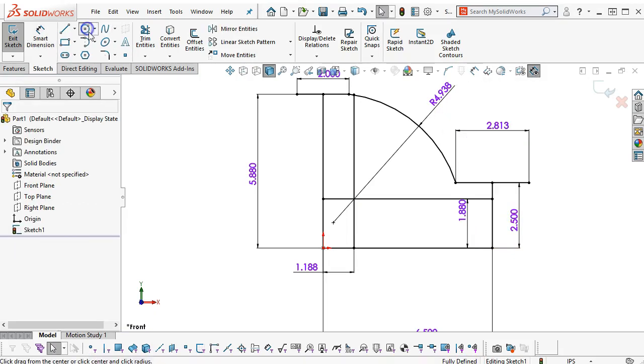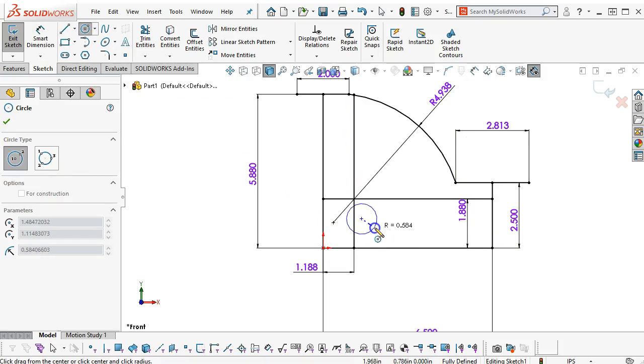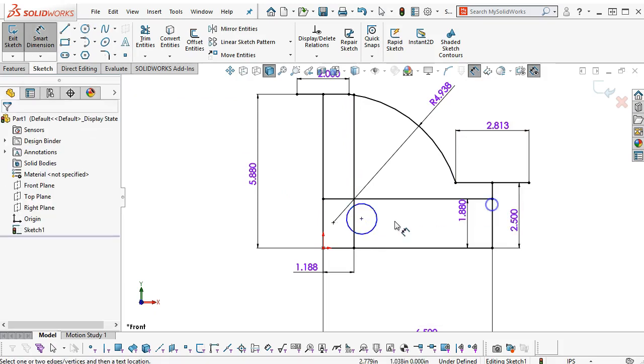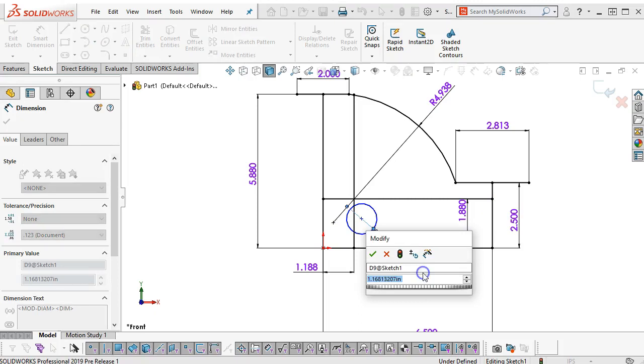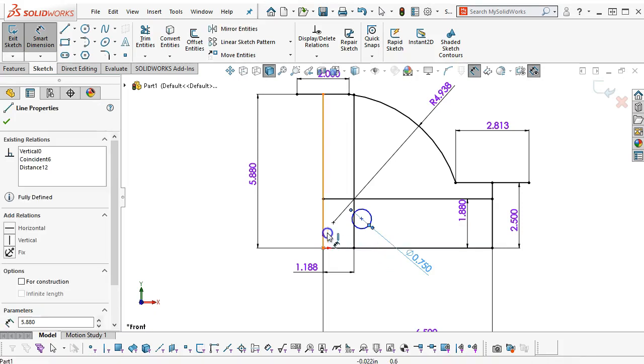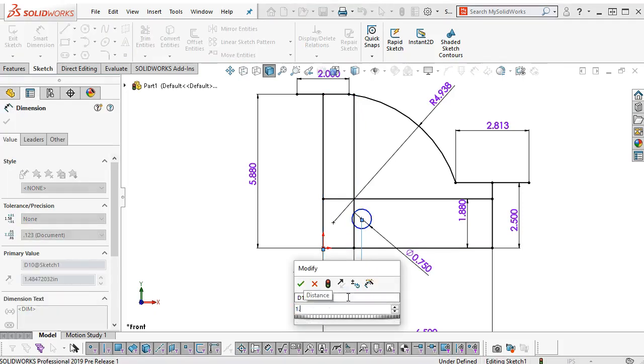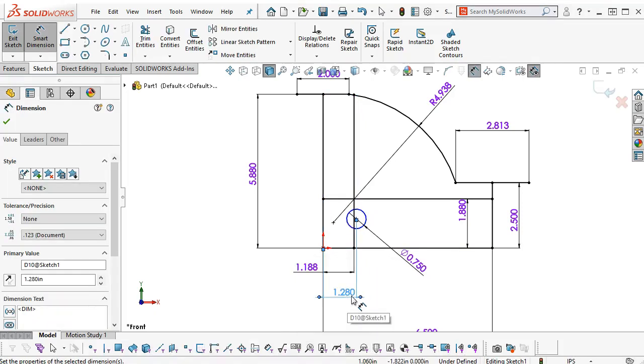We're going to end up with the circular boss, so we have the 0.75 through. I'm going to put it in for reference. And off of that same center line then is the 1.28 to 1.283. So we need to pick one. Alright, so the 1.28, and then its vertical location.